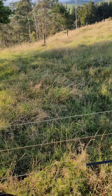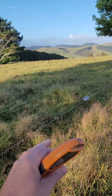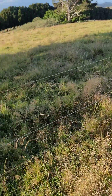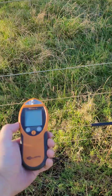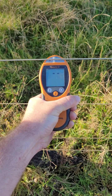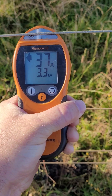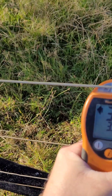How to troubleshoot a fenced short. You start from down near the actual unit to decide which way the short is going. The fence unit you hold up against any electric wire and it'll tell you the number of kilovolts and amps. This one shows 3.1 kilovolts and 37 amps going to my left.